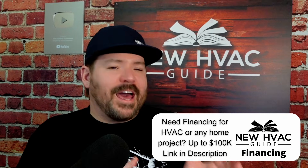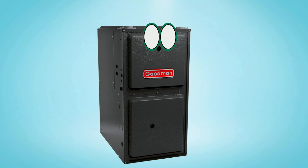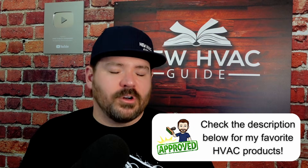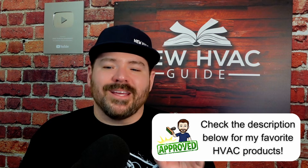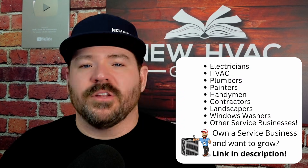What if we did the opposite? What if the furnace's heat exchanger is cracked and we're going to replace just the furnace, keeping the evaporator coil and outdoor unit — both 410A refrigerant in this scenario — but we're going to buy a new furnace that's going to be looking for a sensor? It's going to say, where's my sensor? And if it's not plugged in, it's going to go into an error code and possibly a hard lockout. In this scenario, if you simply read the instructions, a lot of these furnaces have the ability for you to disable the mitigation functionality — it's right there in the instruction manual. You're basically telling the furnace: I don't have a sensor, I'm pairing you with a 410A outdoor unit and a 410A evaporator coil.